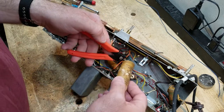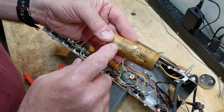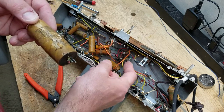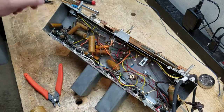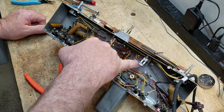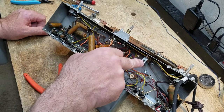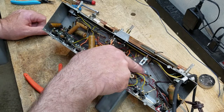Now, there is usually a ground lead also. Common negative is black — so I clip five wires: yellow, red, blue, green, and black. I'm going to set up a couple of terminal strips here and mount all these capacitors in them. Before I do that, however, I'm going to replace the grommets for this tuning condenser because it's easy to get to them here, and I'm going to cut this clip off because it's not going to do me any good. I'll see what I need to do about these grommets before I put those caps in.